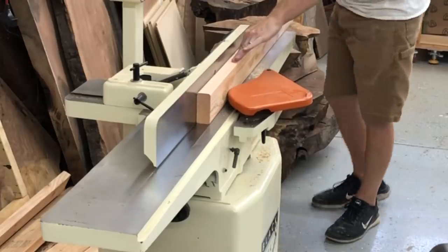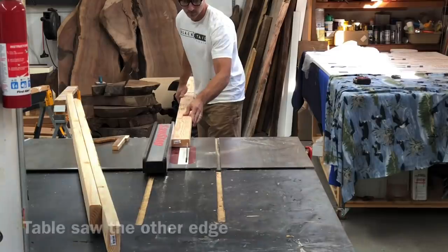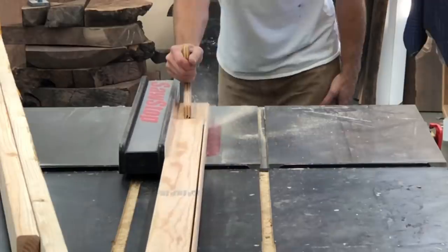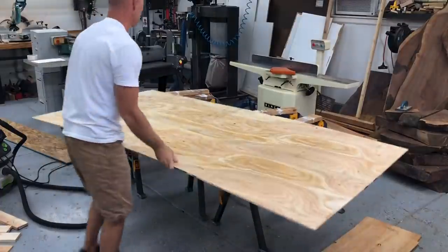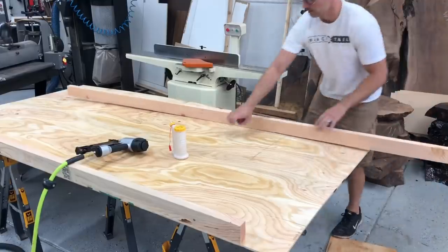This crate was going to be a little different than you might see for a solid wood conference table or even a big granite slab. Because this was wood and epoxy, I needed it to be really well supported while also being a little bit flexible, so any jarring bumps wouldn't actually crack the epoxy.